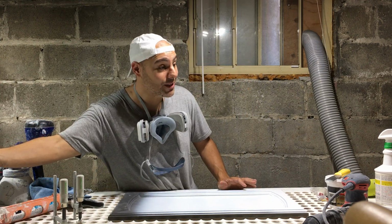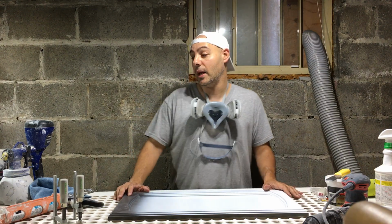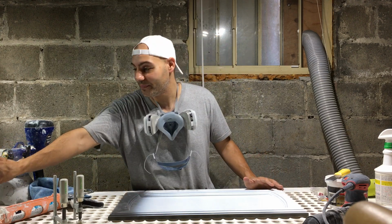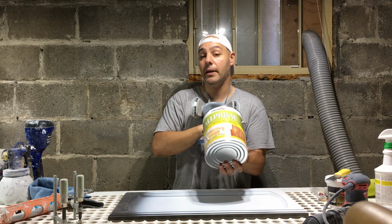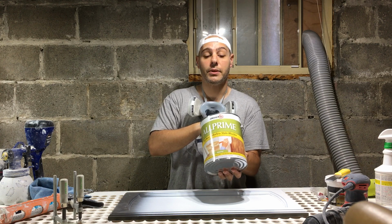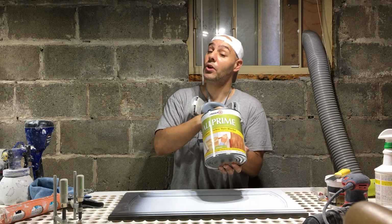And sometimes, unfortunately, the older kitchens, the older cabinet doors, well, they've got grease contamination. So how do we fix that? Hey Tino, how do you fix grease contamination? Well, I like to call it kicking it old school. How do I kick it old school? Well, oil-based primer. What I have here is a Zinsser All Prime. This is a fantastic odorless oil-based primer. I love to work with this. Again, great adhesion, blocks stains, blocks wood resins, and any type of grease contamination that may come through the paint or the primer. This will block it right from the get-go. So sometimes I just end up reaching for this first.